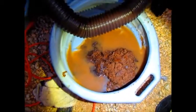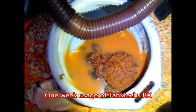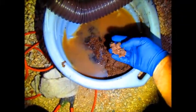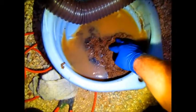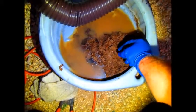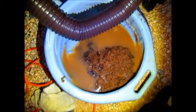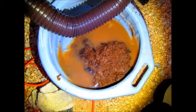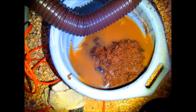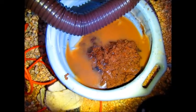The owner of this tank was having trouble with plugging. She switched over about a week ago to TankTex RX, and it took care of some of the plug. What we're seeing is all sandy material — TankTex RX usually breaks it down like this. It has softened the buildup, making it much easier to get out. There's still a ton of it in there, but TankTex RX breaks down those struvites. She had been using Echo Smart in the tank prior.